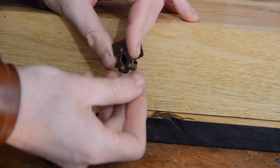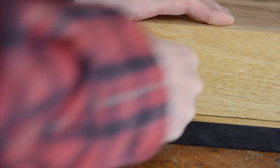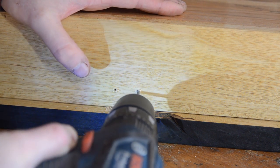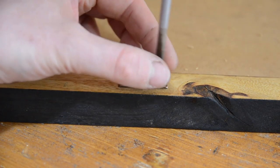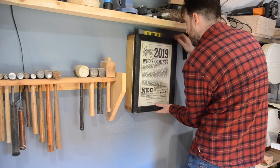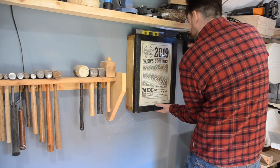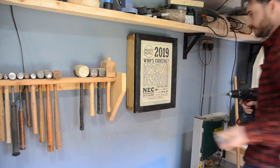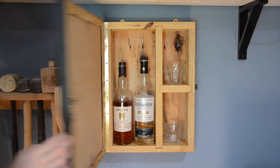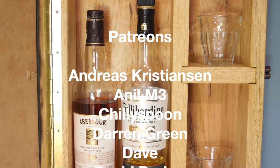To keep the door closed I've got one of these double roller latches. I get this positioned roughly in the centre and then I mark out where the screw is going to need to go with a bradawl. I use a 3mm brad point drill to drill some pilot holes and then I can get some brass screws put in place. And that's it all done - now just to get it put on the wall and get it filled up with some booze. I wanted to be able to get a bottle of scotch and a couple of glasses, but actually there's room for two bottles of scotch and I could probably stack some more glasses if I really wanted to. So I'm ready for a real emergency. Thanks for watching, thanks to my Patreons, and please subscribe for more videos.